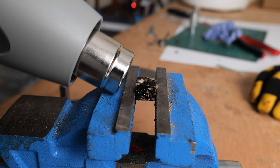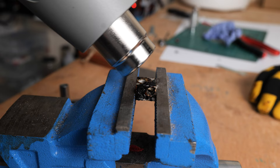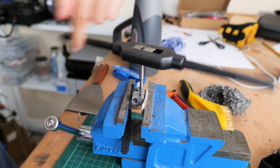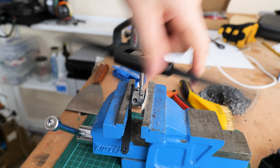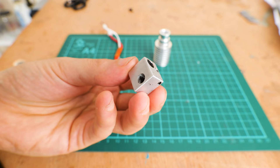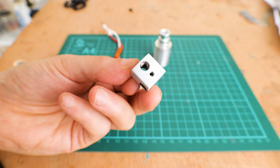Removing the plastic from the heat block was easy but time consuming. I just used a heat gun and scraped off the big chunks, but after a while you end up smearing the plastic around the heat block when using a wire brush. So I got as much off as possible and then I used an M6 tap to re-cut the nozzle thread because burnt plastic had obviously got into that. To get the rest of the plastic off I sanded it down with some 150 grit sandpaper and then finished it off with 600 grit - and you can see it cleans up quite nicely. The divots on this heat block are from where I'm clamping it in my vice - you could avoid this by using soft jaws on your vice if you want to.